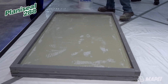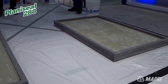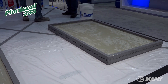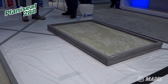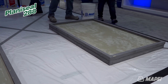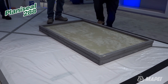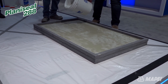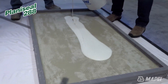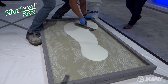Like a cooking show — that one's already done. That panel has the first coat on it with the mesh already embedded in. What he's going to do on this one is the second coat, and he's going to pour it right on. You can usually do about one-eighth of an inch on the second coat. Coverage on the first coat is about 75 square feet per gallon, and the second coat is close to that as well.